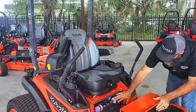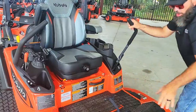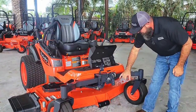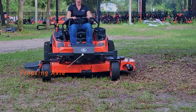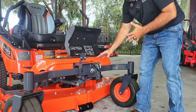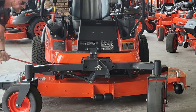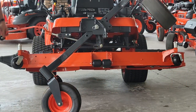You have your fuel filters right here — visible for a daily check, want to make sure those are clean. Up front there's a really awesome two-part system. Right now it's set up in the lock position, but this is a hinge pin for your front forks. This will allow you on slopes for this to move and adapt to the terrain. On the flip side, maintenance-wise, you can configure this to jack the front end up, get underneath there, and change your blades — or if you ran over something and need to clear it out. It'll flip up and bring your deck up for maintenance. Very easy and accessible.